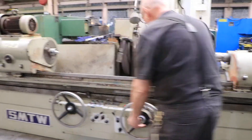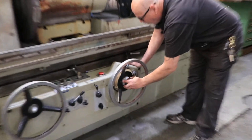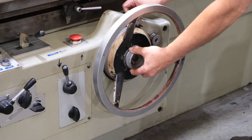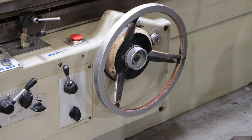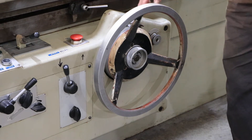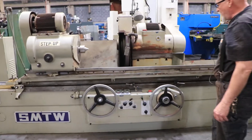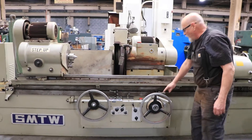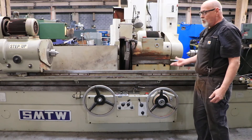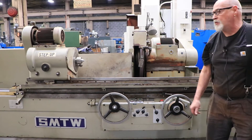In the center of this wheel here, you have a fine dial to rotate the dial around. As I come around here, you see this little nub. When you put this hook down, that acts as your dead stop. These are set up so that this is a ratchet and pawl type of infeed. You've got a shark tooth going all the way around the outside, or a gear going all around the inside of this, except for one little spot when it gets to zero — so it's designed so you don't go oversized. The operator would have to just bring this down to the final couple of thousandths by hand.